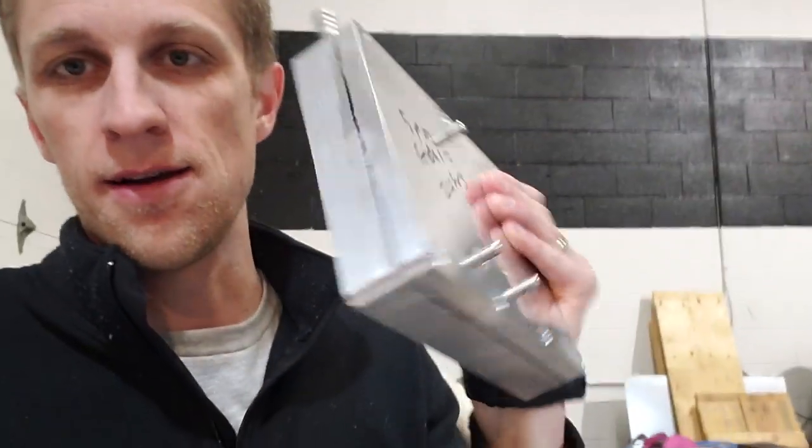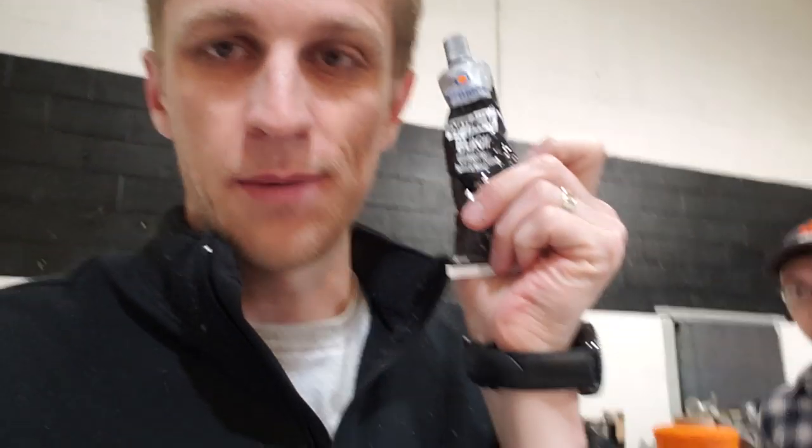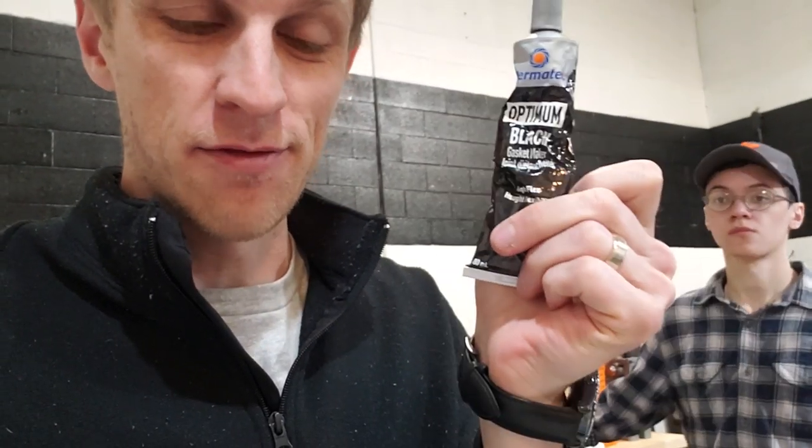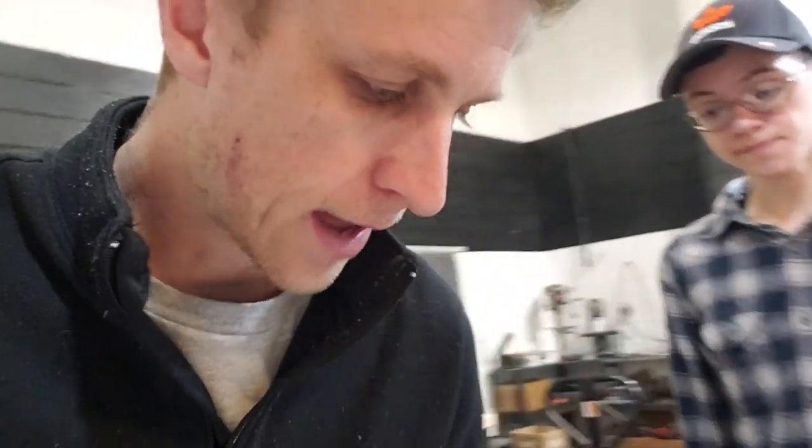With the old setup, John threw it together with copper gasket sealant and it actually corroded all of the aluminum on the inside. So we had to blast everything and replace all the stuff. Now we're doing round two — we blasted the plates, made them nice and clean again, got all the corrosion off. We are now using black RTV instead of that copper-based stuff, so this should work really well. We're replacing all the lines, the bucket, the coolant — everything — so there's no contamination. We want to kill that galvanic corrosion and be able to trust it for the next 20 years.